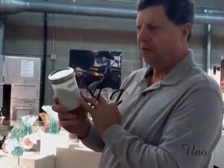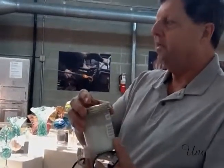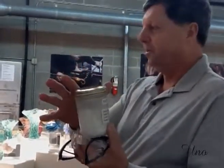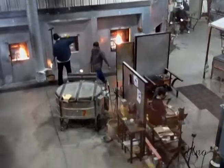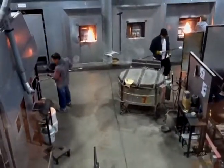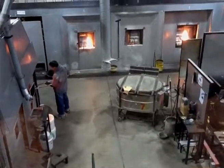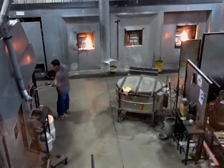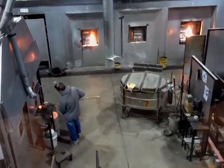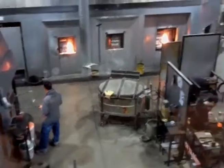We buy container loads of it, we ship it in. We have someone that comes in and he works until 11 at night, and he charges furnaces. He takes this product and puts it in the furnace. Furnaces get turned up to about 2,400 degrees and cook overnight. At 5, we turn the furnaces back down again to the working temperature. By 7, they can start working. So our furnaces run 24/7, 365 days a year, because if we were to turn them off, the glass would harden, and it would take 3 or 4 days to make it hot enough again.